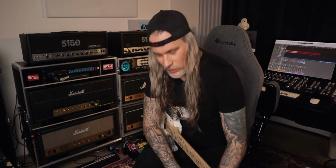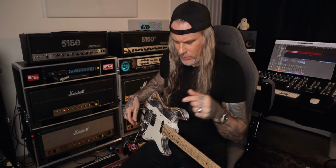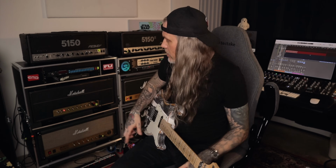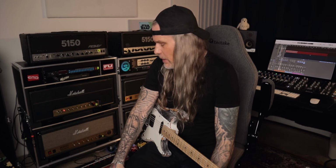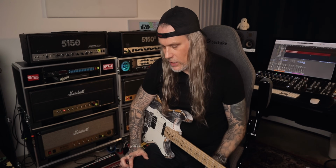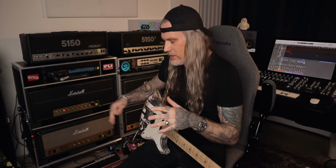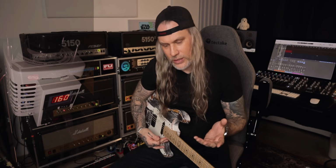Because my friend, my colleague and my amp tech, Eric Studer, here in Switzerland, he's also an official Marshall repair guy. So he's suggested a few things I could do to make this amp even more, more is more, kind of what I want. They're basically similar to what is usually referred to as Van Halen mods: the fat cap, then biasing the amp according to the Variac that I'm using it with.